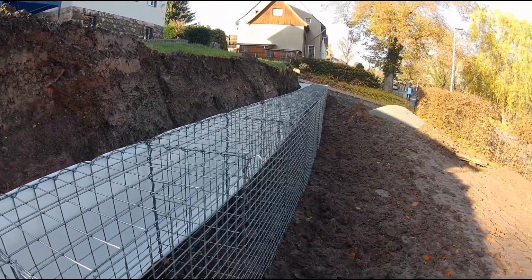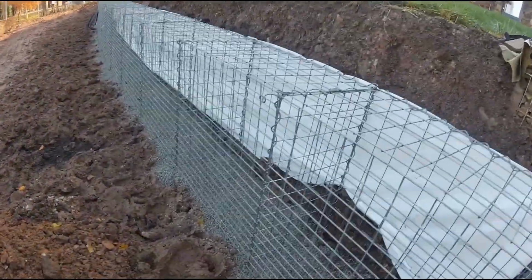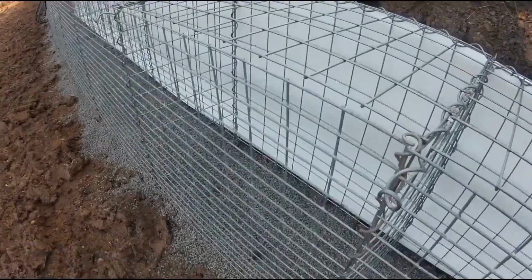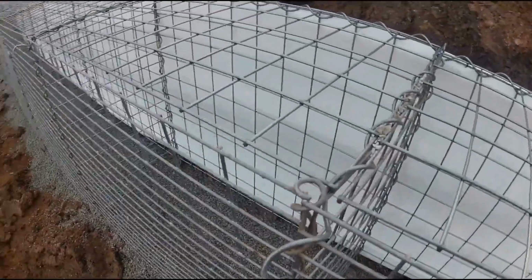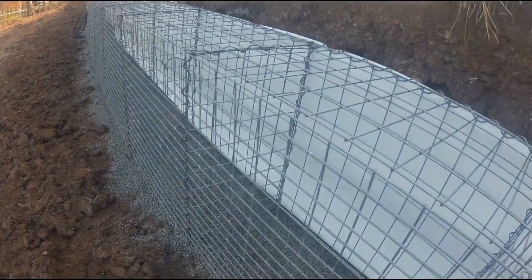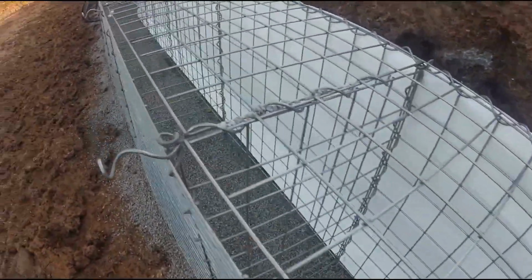Then I can carefully align the gabions with the gravel. I carefully poured the gravel into the stone baskets, at least 10 to 20 centimeters high, gently and with precision. I can align the baskets in line and level through the gravel. It is quite easy to do this by shaking and vibrating. That looks pretty good, doesn't it? There are still a few small corners left. That will be put into perspective when I fill the stones and finally align the stone baskets. The entire bottom of the basket is filled with gravel. This way, the granite stones will later lie flat.